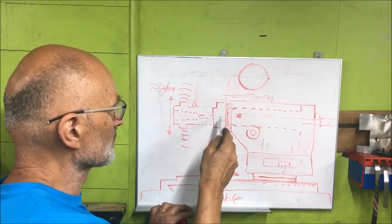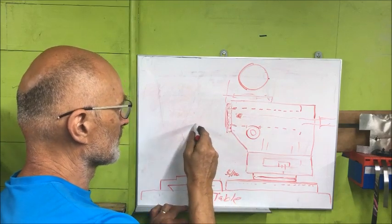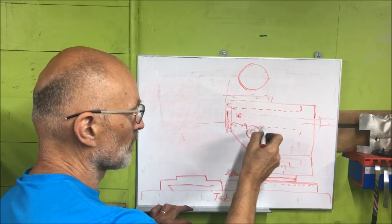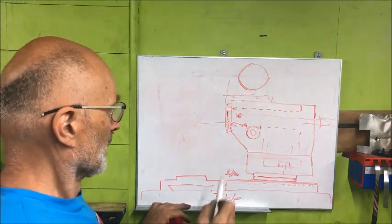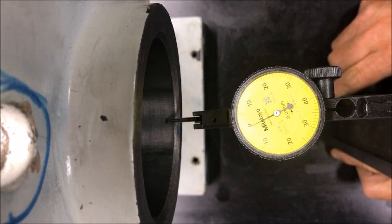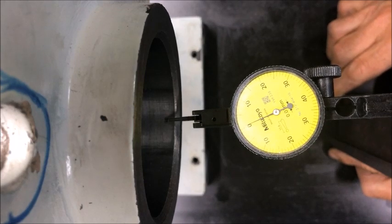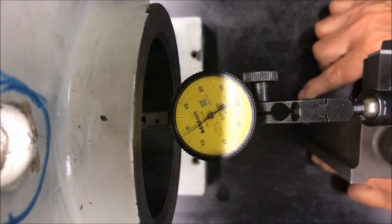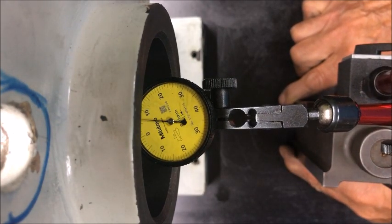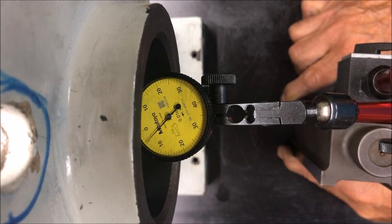Now I measured outside on the spindle, and I also removed the spindle altogether and measured inside the bore with a test indicator like this, going a little bit in because I'm meeting this hole that is machined for the rack feed. New indicator setup — sorry for the glare — going into the hole, finding the lowest spot, so just a hundredth off. There we are. Then going all the way down to where you can see it, and then up and down again — and you see I'm already like five hundredths off.